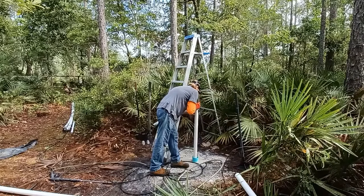Okay. I'm going to try to leave that 2-inch shaft down into the ground. I had so many comments about, well, why don't you leave the 2-inch shaft down there and then sink down the well point? So I thought I would give this a try. We're going to go ahead and push down this pipe. This is a 20-foot section of 1-inch pipe, and it already has the foot valve on it. So I will go ahead and try that. We'll push this 20-foot piece of pipe all the way down and see what happens.